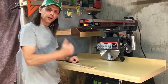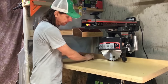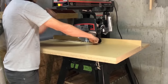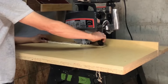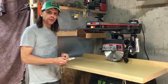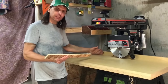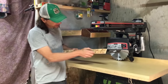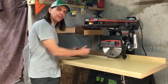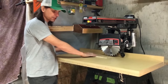Another cause of kickback is when the kerf — the slit in the board you just cut — pinches. That naturally wants to happen as the wood comes out of the saw. That's what the kerf spreader wheel is for: to keep that kerf open. Also, make sure whatever piece of wood you're ripping has a completely flat, straight edge to ride against the fence. If there's a cut or irregularity, the wood can move away from the fence, allowing the blade to grab it and kick it back. You also don't want your wood to wobble — you need a nice flat bottom when sliding the wood through.